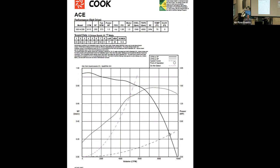Now, with the energy efficiency regulations, you will not be allowed to make selections this far away. In other words, having that amount of safety factor, because it's not very efficient. You'll be driven to make selections higher up the fan curve. You have to get it within 15 points of peak total efficiency. It's already baked into code for 90.1 compliance. And you have to be within 10 points of peak total efficiency for the REACH codes in 189.